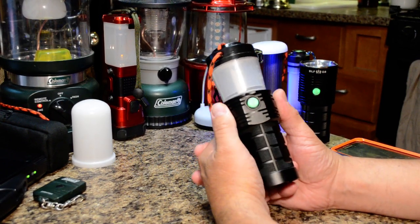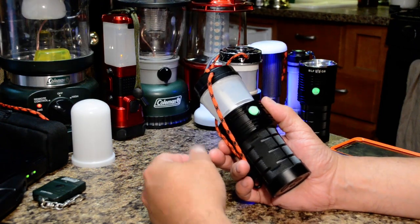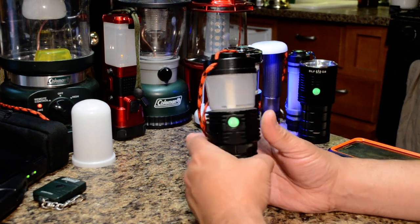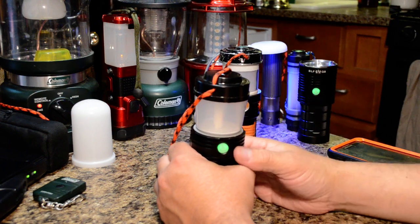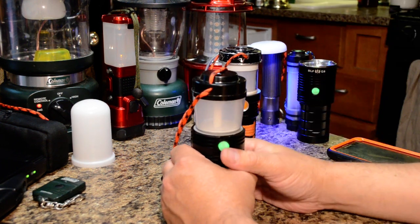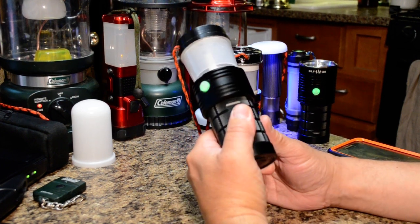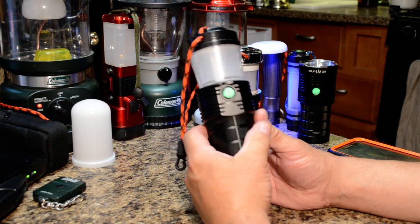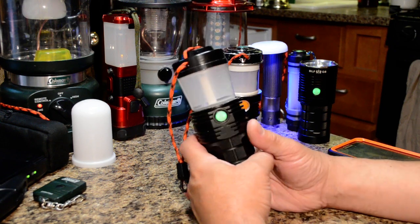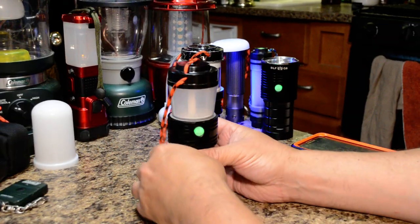The main purpose of the lantern is building a compact rechargeable lantern with good modes, better tint, better CRI, and better quality — and it's metal. A lot of factory ones are plastic, even the more expensive ones, like this $100 plastic model that uses alkaline cells. Even with the best alkalines like Energizers, this one takes eight D-size cells, gets expensive, and on high it only runs roughly eight to nine hours maximum before it shuts off. The BLF prototype is brighter than the larger one and will run 12 to 15 hours on high at much better output and tint, at a fraction of the size.